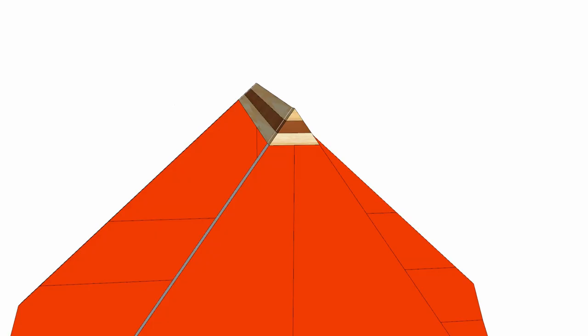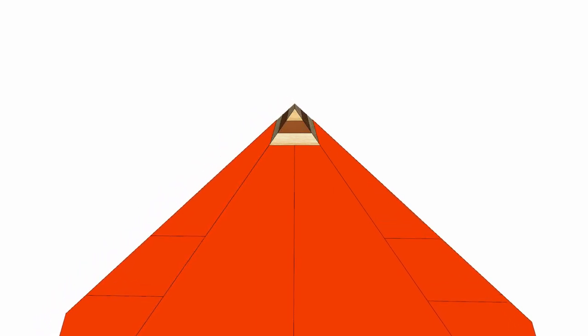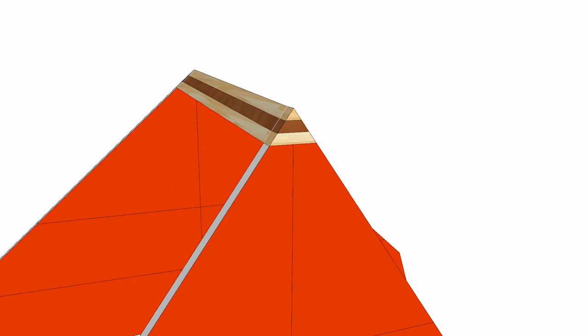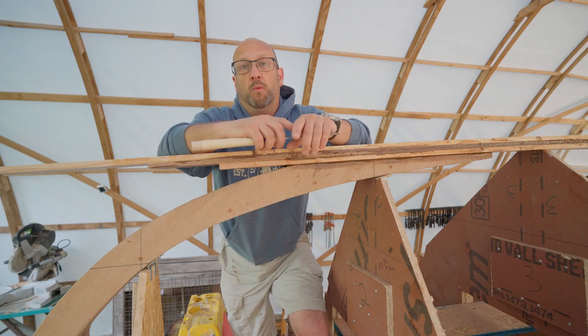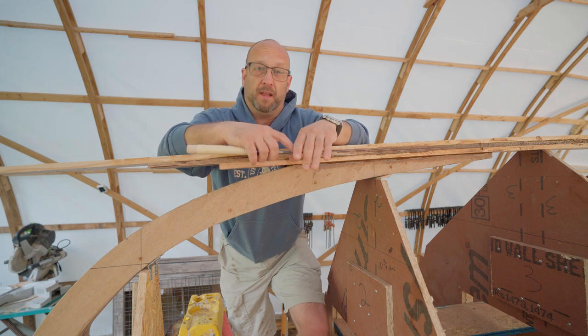And as you can see here, the station mold, if you continue up the sweep of the top sides or the sides of the triangle to a point, that's what the keel is going to wind up being at each of the station molds. And then by fairing those cross sections together, you wind up with a seamless, fair surface for mounting the bottom planking.